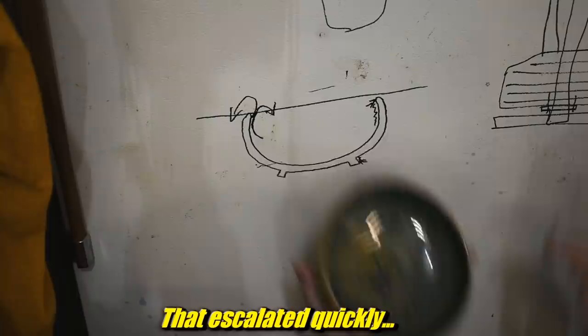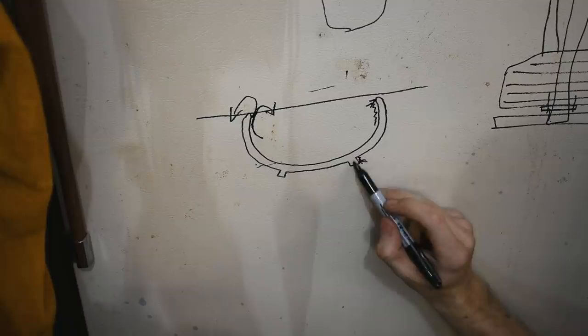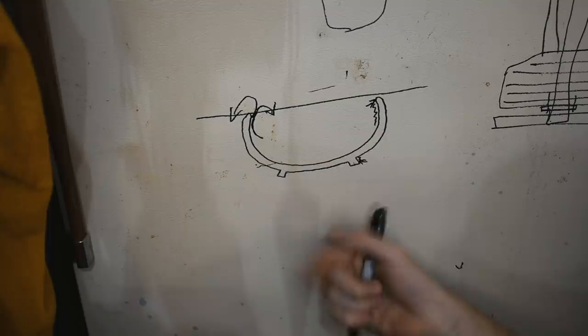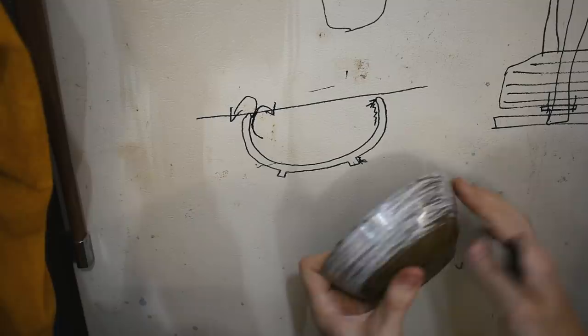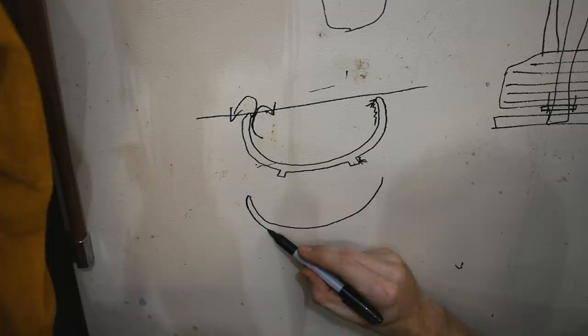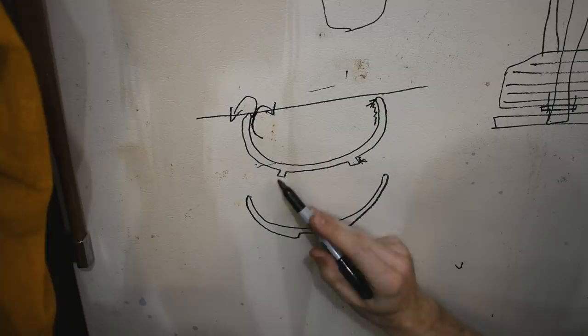The other benefit is that it's kind of even thickness all the way around in here. I know I can achieve this even thickness because I have a two-year-old who occasionally grabs something and throws it on the ground, smashing it open, and I get to see the broken edge. This one I made for this challenge has clear glaze — red clay slip splashed artfully and white clay slip painted. The inner shape has no undercut at the rim, and the outer shape gets thicker and then has a foot cut in it, so there's no undercut anywhere. If the parting line is here, I can pull the sand apart and take the bowl out and no sand will fall out.